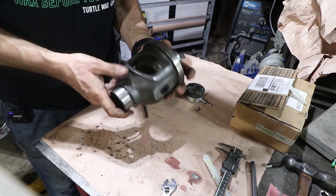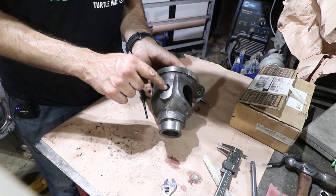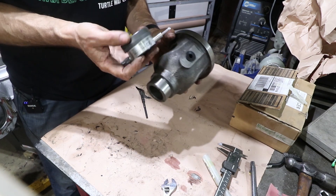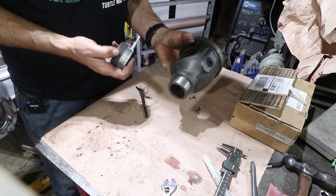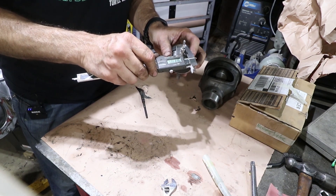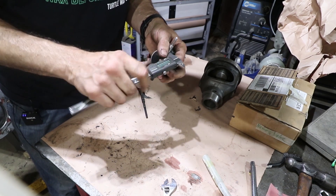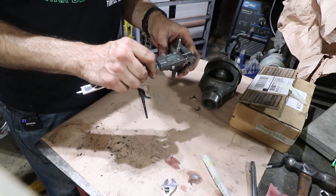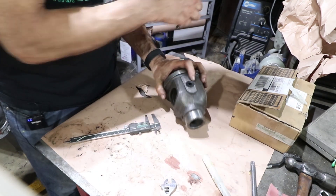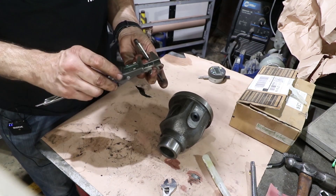I'm back at home now, working on this bushing. This is a Delrin bushing that I machined at the workshop. It goes in a hole just like that, but on this side that's been milled flat, and what that's for is this dial indicator is going to go from the inside and fit right there. I want it to be a precise fit — there's a 3/8 diameter shoulder here, measuring 0.372–0.373, so I'm going to ream it to be a nice fit rather than just drill it.